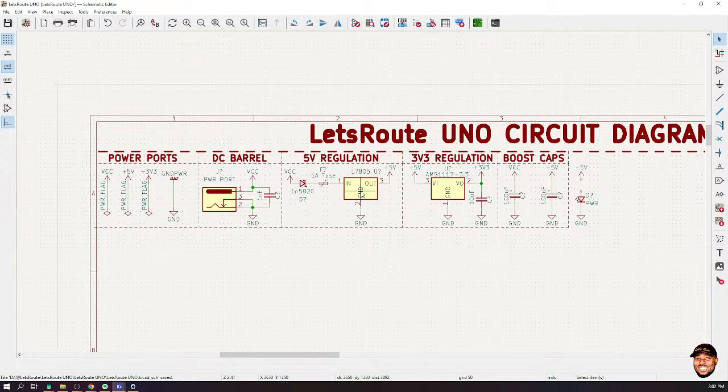Okay. Now, I just made an analysis. Even if you draw 20 milliamps from all the Arduino pins, the digital pins, that would be a total of 400 milliamps. The IC itself operates below 50 milliamps. Now, even if we give the rest of the components on the board 100 milliamps, that would still be a total of about 550. So even if we rate our Arduino at 600 milliamps, it is still workable. You see, the mistake people make is trying to source so much power from the Arduino's 5 volts pin. But the Arduino board itself doesn't require that much current.